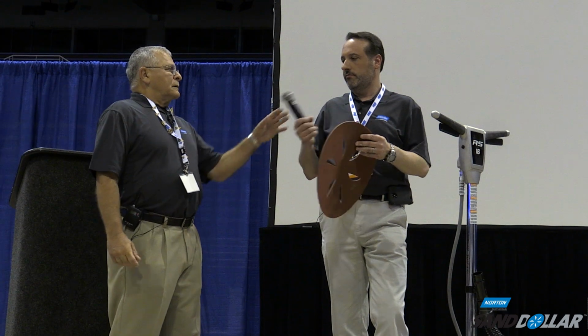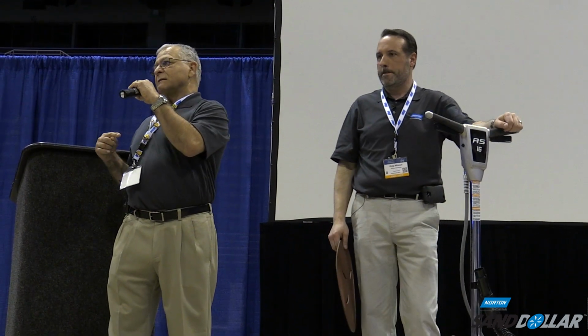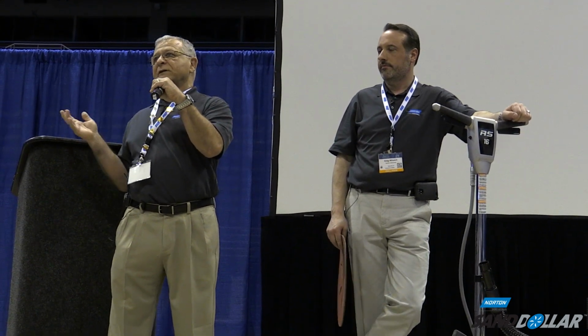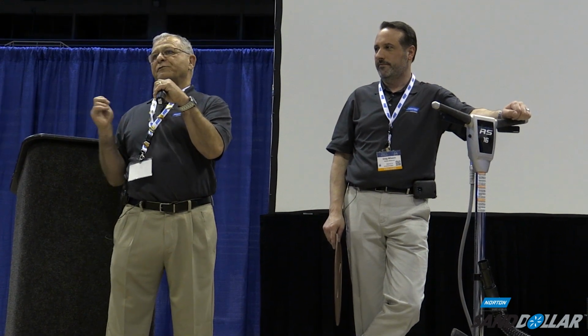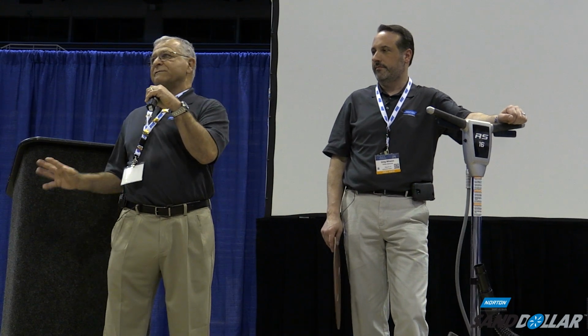You can try and vary up the backup pads, and also kind of what you're doing. Again, you can do a couple different screenings to really refine the scratch. Another point is you get some powder buildup on these SandDollars. Just hose them off, vacuum them, beat them out, put them back in your truck, let them dry, and use them again. Don't think that they're done. If you vacuum them real well, pound the dust off of them and hose them off, you're going to save yourself a bunch of money.